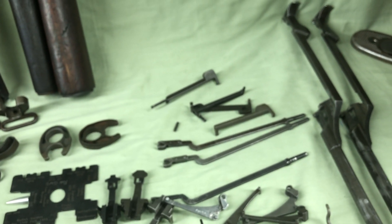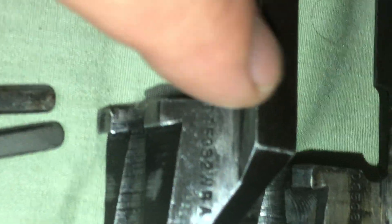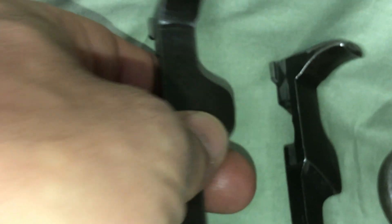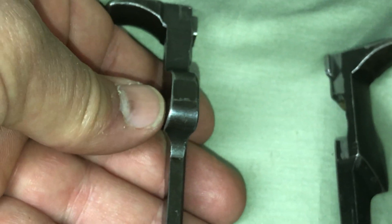Op rods: this cut here - there is none, it's 90 degrees uncut - that's a World War II one. Then there's one with a small thin radius cut made later on. The later ones had a much larger semicircle in there, and usually that semicircle would not go down into the part number - though some later ones did, so be careful. This is a slant cut on the sides from top to bottom - does it have a slight curve to it? That's noticeable especially when you have the ones called square, which are straight up and down. Are there any other markings on it?